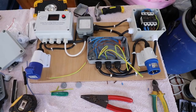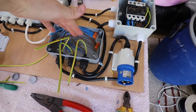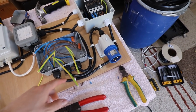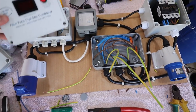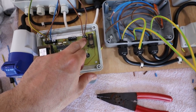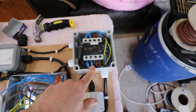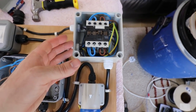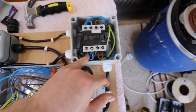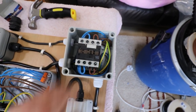This is the final wiring layout - I'm not doing this again, it's a pain in the neck. Power comes in here, goes into the switch box, then junctions to both the controller and the relay. Following the power: the controller is low amperage, just powering itself and then splitting off to the heater relay signal. That little wire goes into the big relay, which is powered by mains. I've used two poles for live and two for neutral straight through, just because I can.